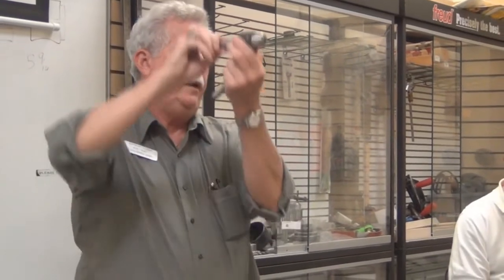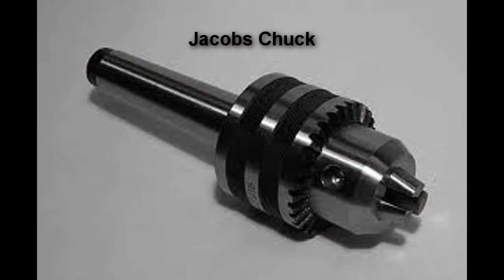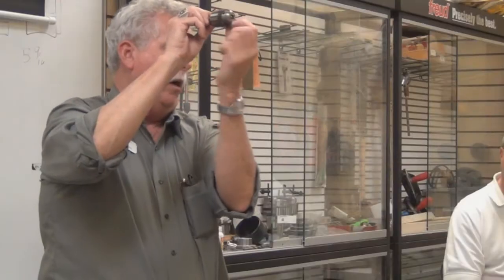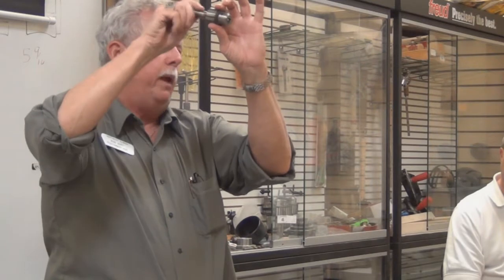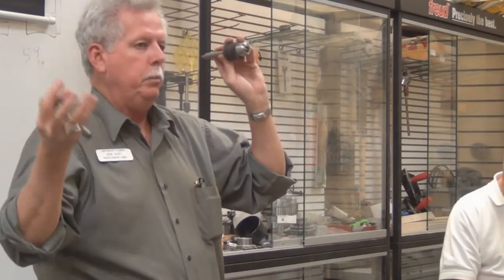Jacob's chuck - it's like in a drill press and the teeth are pointed like that. If you're going to turn something where you hold it in here, it's going to crush the fibers. So Craft Supplies took a bunch of those and they drilled the teeth off so it's round inside. This is made for 3/8-inch dowels. If you're turning bottle stoppers, it's a standard 3/8-inch dowel that goes through the center. It's really good for that so that when you take it off, it doesn't crush the fibers that you now have to cut off. Using the regular Jacob's chuck, it'll crush the fibers and things will snap and split.